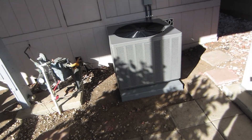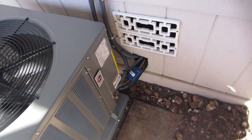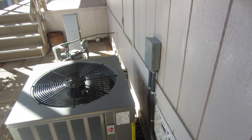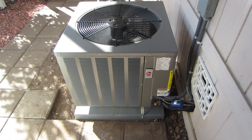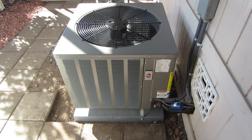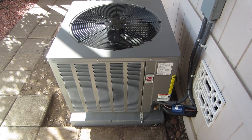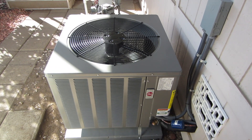The unit is nice and quiet. The customer is pleased with the install — they're actually going to pour a new slab around this unit to take up the pavers. You can see the refrigerant piping and it has a new disconnect. I made it so you can actually pull that unit out six inches side to side without disturbing the refrigeration piping, so it's going to be nice and easy to get that slab in. I hope you enjoy the video.